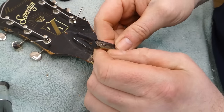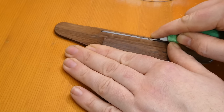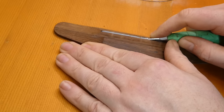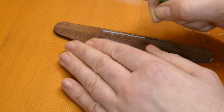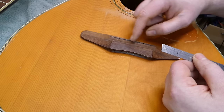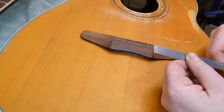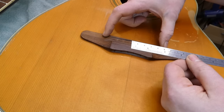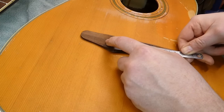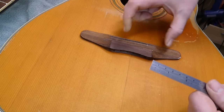One of the reasons I favor these Scandinavian-style carving knives is they have really wide flat bevels, which allows me to register against the curved surface of the heel and transfer it. I'll follow that up with some file and sandpaper work. The nut has been glued on with a substantial amount of something like epoxy. Looks like I'm going to be routing a deeper saddle slot — the front edge of the bridge has been planed down slightly, and the remnants of the saddle have been glued in place. They're only about a millimeter and a half thick, so we need more than that. Because the bridge has been planed down and there are tapered side wings, it makes sense to change this into a blind slot rather than the through slot it has now, or every pass will extend it out into the tapered section. Before you know it, you've got a saddle that's like four inches long, which looks weird and isn't structurally great. It'll be about three and three-eighths of an inch long, which is fine.